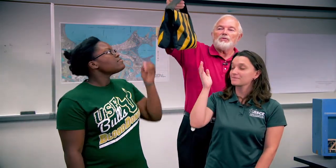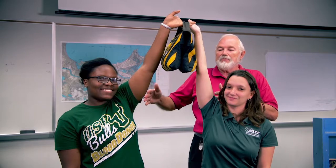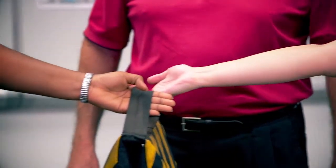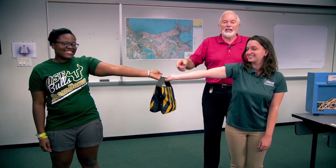We're going to take a look at weights and how they relate to tension and compression in your bridge members. To help demonstrate this, the two of you hold this weight up high — it's not too hard to hold. But as you move further and further apart, the tendons in your arm go into tension, which becomes painful, while the bones are in compression — and that's what's holding up the weight.